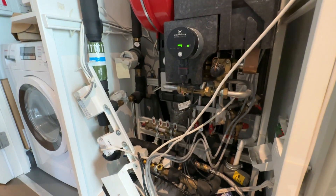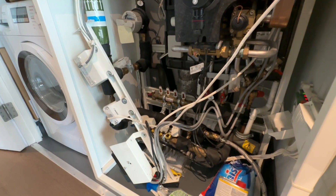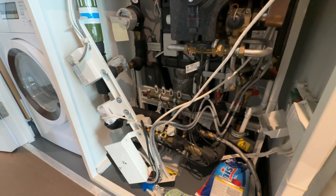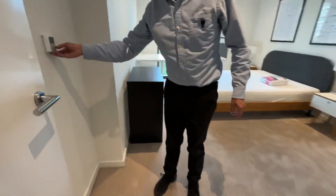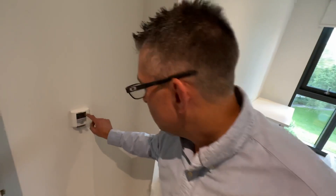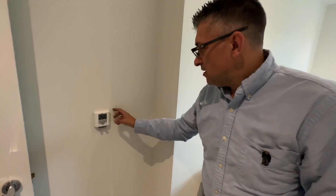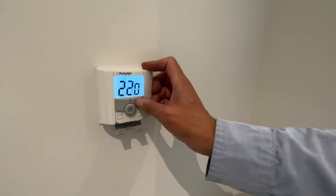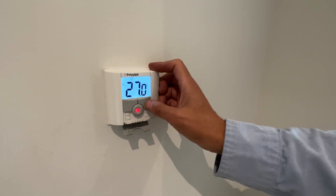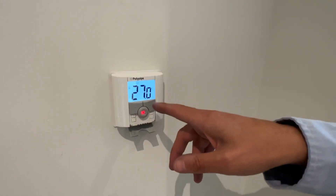We're going to put those valves back on in a minute. The key thing is that when you're starting a system up you've always got to adjust your thermostats to a high enough level. There's no point having it set at 23 — it won't call for heat if the room is already at that temperature. Set your level high to start with, maybe 28 or 30. In winter it suddenly came on — we know this room is at about 26.5 and I had to get the thermostat to 27 to call for heat.